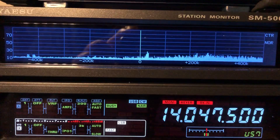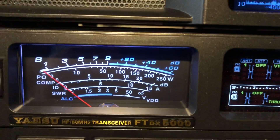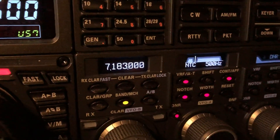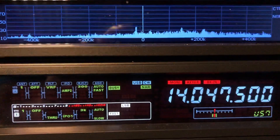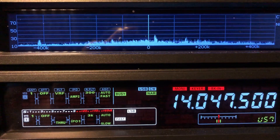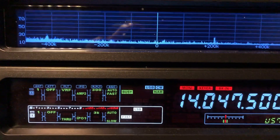I can increase this S meter reading, but then I'm listening to a noise floor. Contour or APF can help minimize that. And there's my notch filter trick to take out some of the ring from that steep skirt on that Chebyshev filter. But without any of that — just with the VRF — I can move the peak away from his signal, drop the noise floor, and when he transmits I'm still going to hear him very well with a better signal-to-noise ratio.